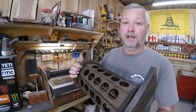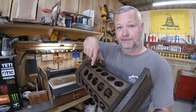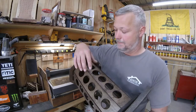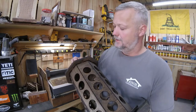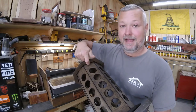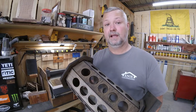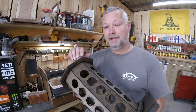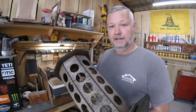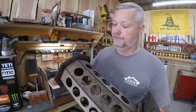One of the files is called locking rings. This is a locking ring that holds everything together. Inside there's a plate and the notch plates. You take those notch plates — there's a notch on each one of the panels — and when you line the notches up, you use glue. I use Titebond 3 regular woodworking glue and put a little dab on the back of the tab and press it in. One thing that's worked well for putting this together — because it takes coordination or teamwork — is to use painter's tape as you place these pieces, then let the glue get tacky enough to slide the locking ring over the top.